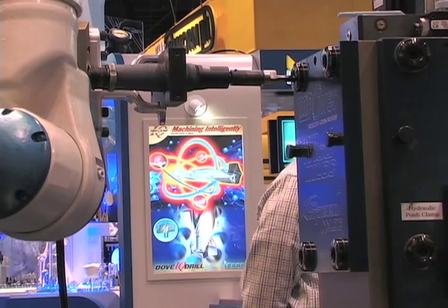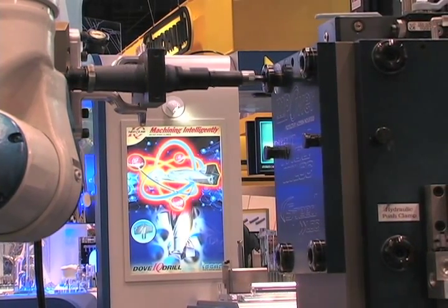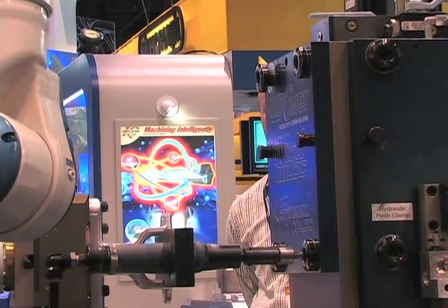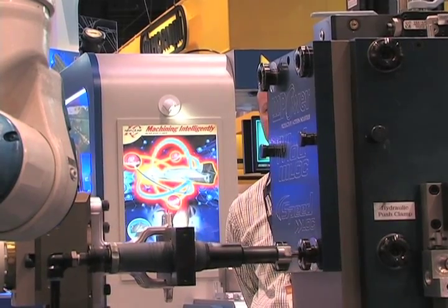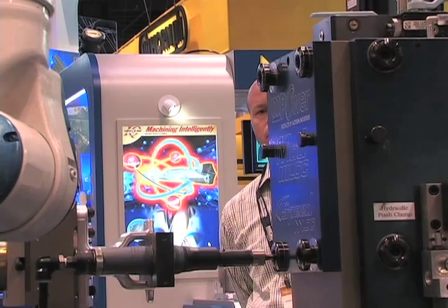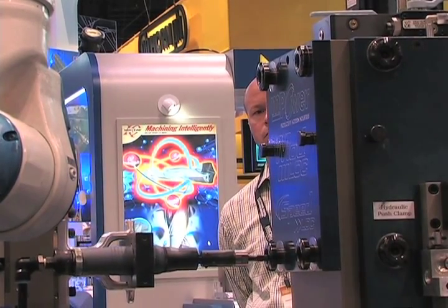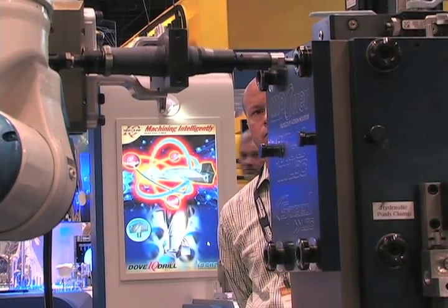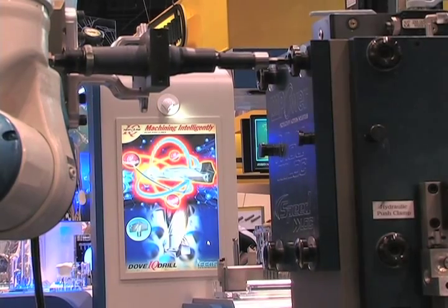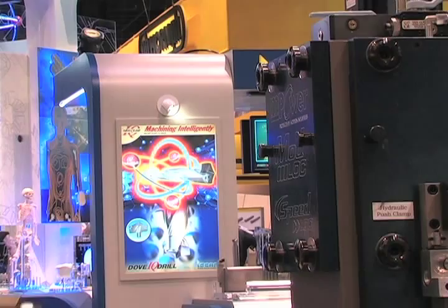What we're doing is demonstrating that the product self-extracts. Because the Speedlock self-extracts and repeats within four-tenths fixture to fixture, we're able to use a robot — a robot arm can come in and grab the Speedlock to disengage the fixture plate from the tombstone. The self-extraction part is probably the most important aspect of the Speedlock. None of the other systems on the market do that, hence you can't use a robot.